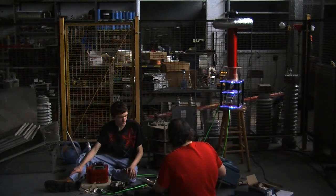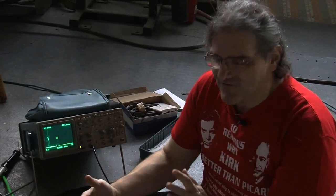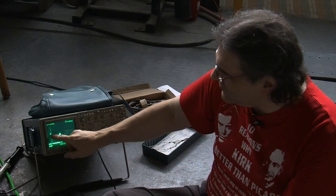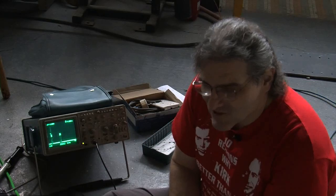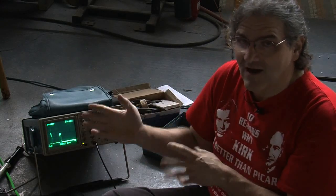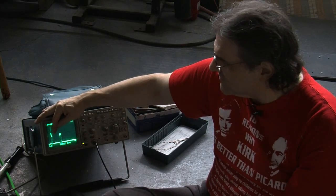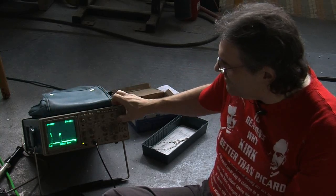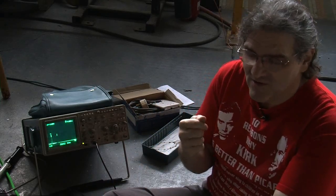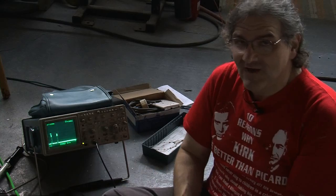It's running right now generating pulses and I'm looking at the waveform of the notes, looking for when the next waveform is going to hit, and I use that to turn the output on. It's just a straight digital output — no sine wave, no attack, sustain, or decay. It's either turning the coil on or off. If we were pulsing at 440 Hz, that would be an A, and I'm overlaying multiple notes on top of each other.